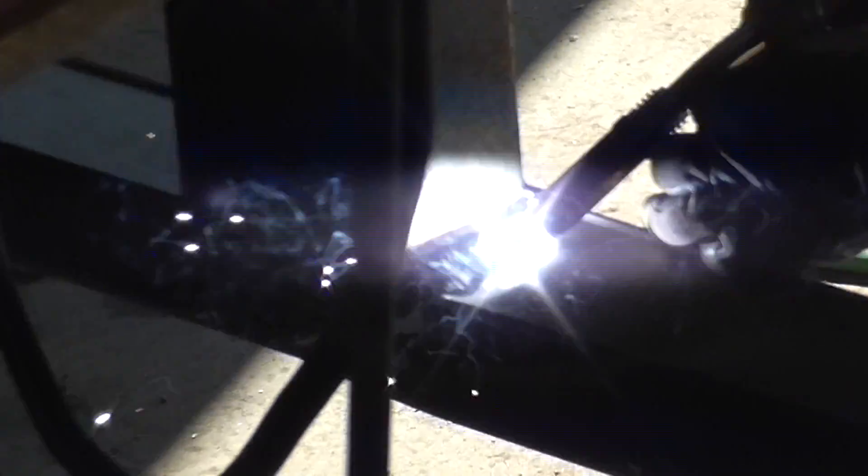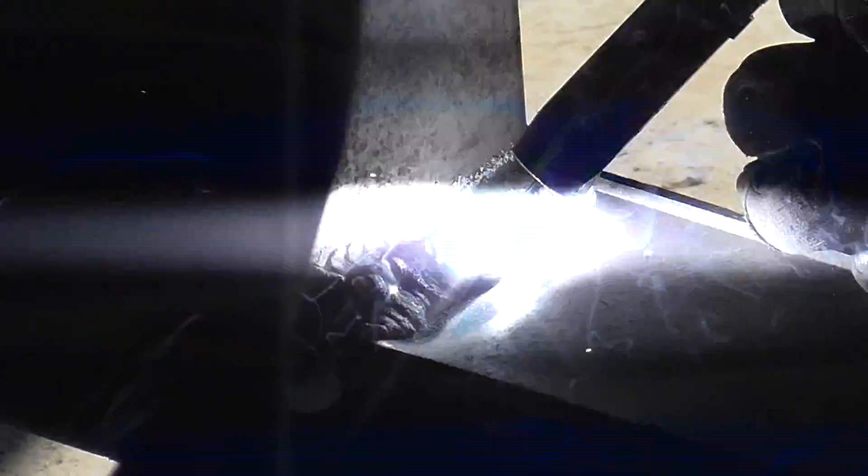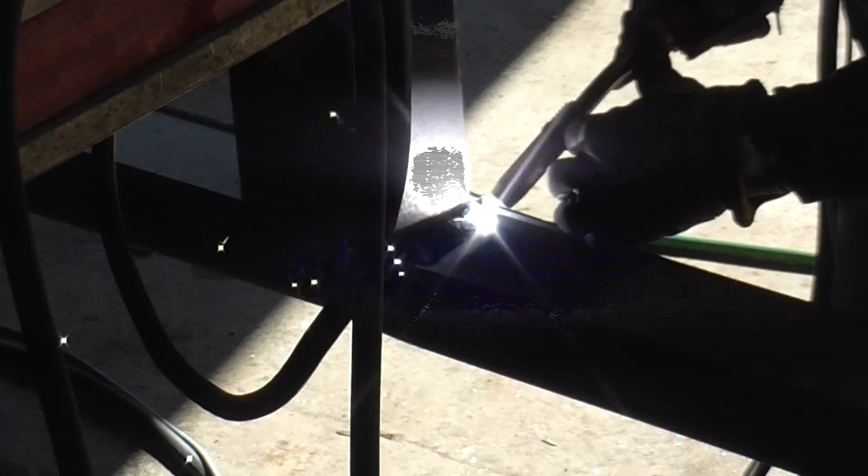If you've wondered about the difference between a full synergic pulse MIG machine and just a spool gun — with a spool gun, you absolutely cannot do this. Because aluminum is a spray arc transfer and spray arc is hot, the thinnest you can weld is eighth inch. If you're really good you can weld a hundred thousandths, and maybe some people with a very steady hand can go a little less. You can never bridge a half inch gap without breaking the arc — it would be way too hot. Jeremy is pulling the arc slightly instead of pushing it, which is old MIG habit muscle memory. It does leave a little shadow of black soot, but it wipes right off. Ideally you'll be pushing. Wire brush it and run a nice hot cover pass over it.